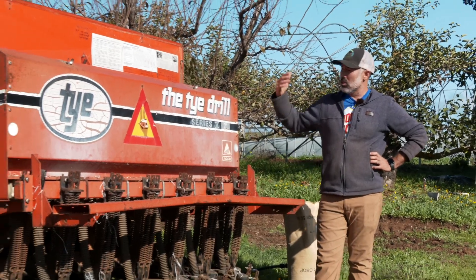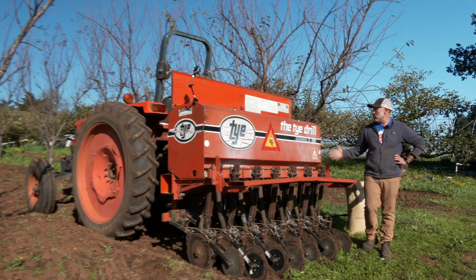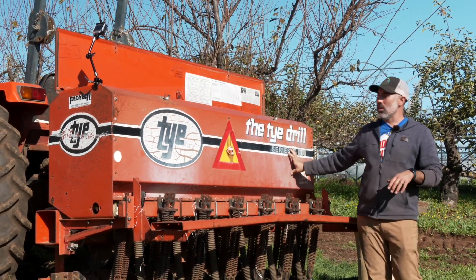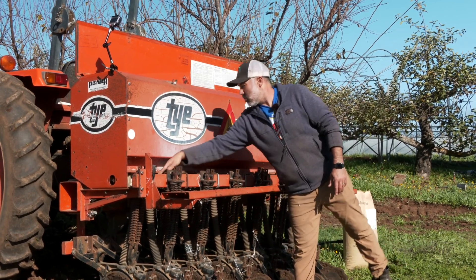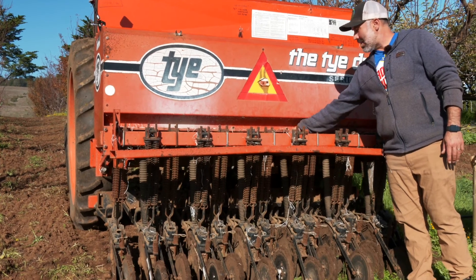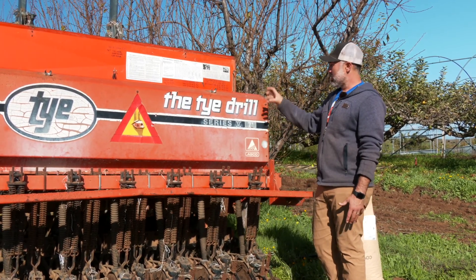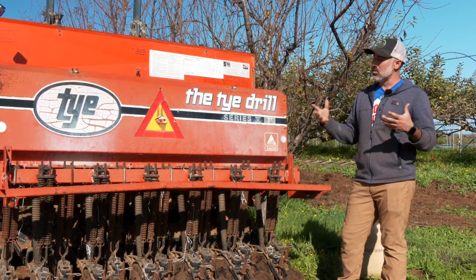We're in our orchards — our stone fruits — and we're going to put in some purple vetch seed. Our grain drill is a pretty small seeder, about six or seven feet wide, that fits right behind our tractor. This up here is the hopper where I'll put all the seed — it can hold up to about 300 pounds, but I'm just putting in about 40 pounds for this sowing. The seed spreads along the bottom of the hopper, and below it there are 13 individual drops. We determine how fast the seed runs out by two things: how wide the opening is — adjustable on the side — and a gear ratio that controls how fast a rod in the center spins as we move across the ground. The combination of those two things determines how much seed we drop.